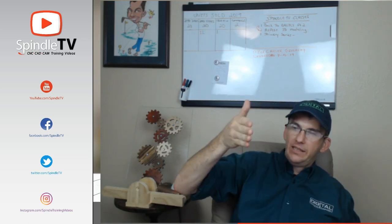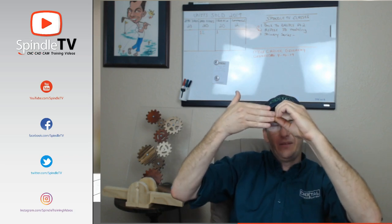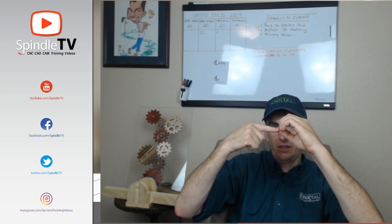And then in your controller software, you would type in 0.5, telling the software that you're 1/2 inch away from center, from zero. So that would be the way you would touch off your bits, your Z. You'd bring it into a known distance in that live center. That bit would come to the outside edge of that 1-inch diameter live center, and 1/2 inch is the center of it, where the center of our stock is. So we would program in our software 0.5 inches. And then we'd back off and run the job. So we're telling the software that the tip of the bit is 1/2 inch, 0.5 inches, from center, which is zero for us.